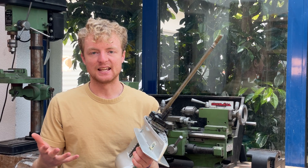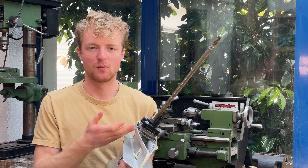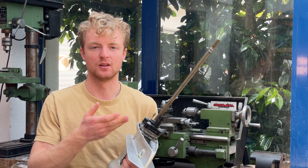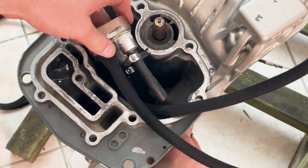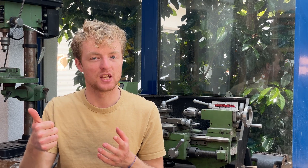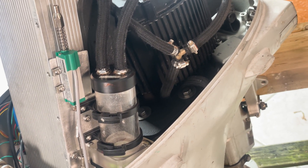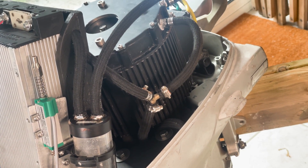I designed the entire cooling system around the original water pump located in the lower unit. This pump will bring salt water into a heat exchanger located a little higher in the oil pan. The cooling loop is made with PC water cooling components. They are fairly cheap, reliable, and running off of 12 volts. This system will keep the controller and the power head cool.